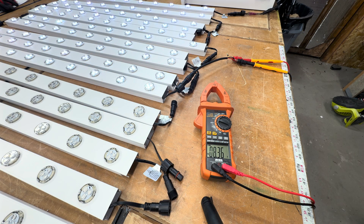I have 100 lights here. The pucks are looking really good — all pure white, nice and solid, good color on all of them at the 100th light. The voltage is now 8.36 volts. That's getting down there, getting pretty close to where we might need some power injection.